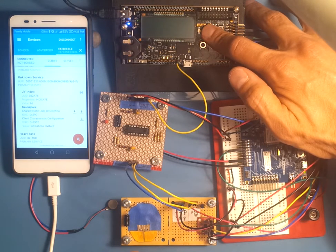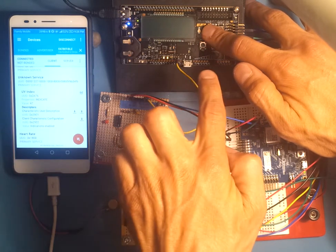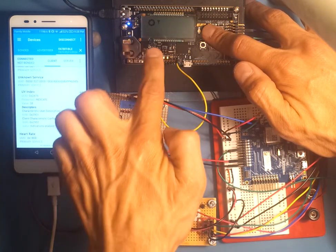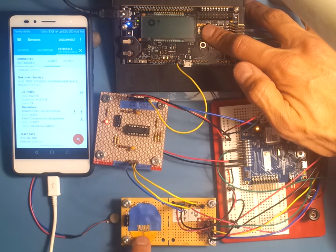This is a homemade pulse sensor, and the yellow pads here are a capacitive touch sensor, which is hooked up to the LE sense part, the analog comparator on the Leopard Gecko. When you touch this, you see the little antenna light up over there. What that does is basically turns on the infrared sensor and emitter here.